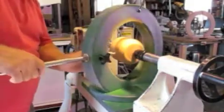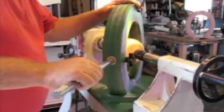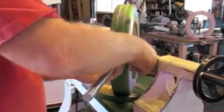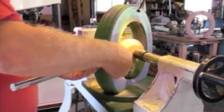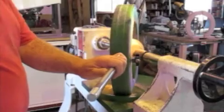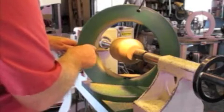The lathe is spinning. I need to trim it off, starting at this end. I'll just snug this up a little bit. I'll loosen the knob, push the tool in a little bit, come back, push the tool in again. I can see that this end here needs to be cut away, so I'm going to pull the cutter out a little bit and whittle away at that.